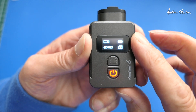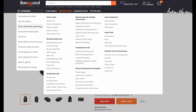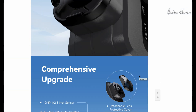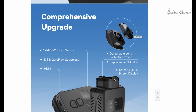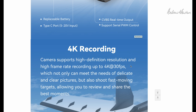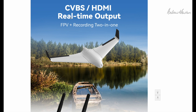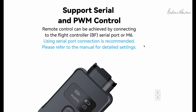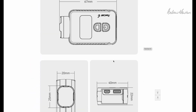Let's have a quick look at the website and the manual as well. Looking at the Banggood website, current price is $105.99. The sensor is a Sony IMX377, slightly different to the Runcam Thumb Pro which uses an IMX577. Over at the Runcam website they're saying it's a comprehensive upgrade with a detachable front cover, and you can put ND filters on there to slow down the shutter speed and stop overexposure, which gets rid of jelly video. It has video out and HDMI out and you can use this as an FPV camera and record at the same time. The pre-record feature is pretty cool. It also has serial and PWM control via your flight control board, and the same dimensions as the previous Runcam 2.